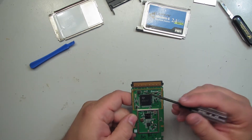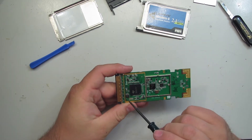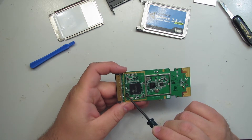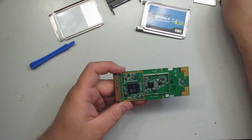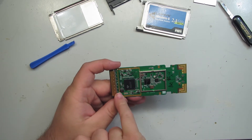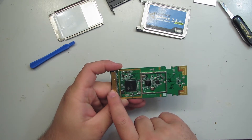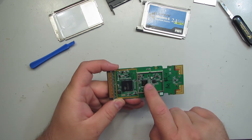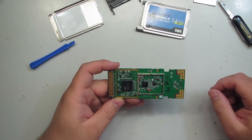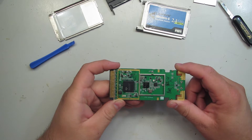We've got some passive electronics here — looks like a couple of power regulation circuits, an E-squared PROM, that is an EEPROM or electronically erasable programmable read-only memory, which is the most ironic name I've ever come across in all my experience with electronics. We've got an Atmel EEPROM and a system-on-chip that acts as an interface between the PCMCIA host controller and the RF transmitter, specifically designed to handle all of the encryption in hardware and to manage power.